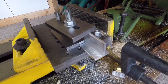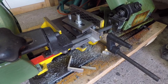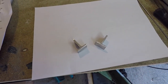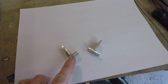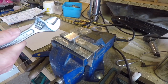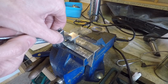I've set it up on my bandsaw holding fixture and I'm going to cut it in half. Here are my two halves of the test piece. The one on the left I've just filed off to see whether there's a gap in here. It looks like there isn't a gap, but I wonder whether that's just because the soft aluminium has burred over and filled it.